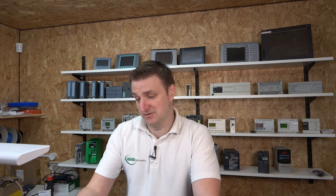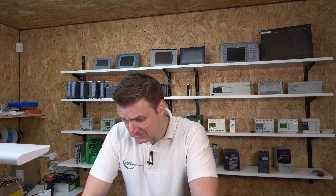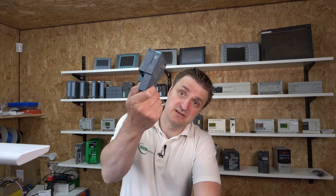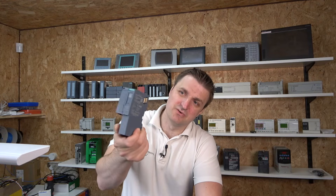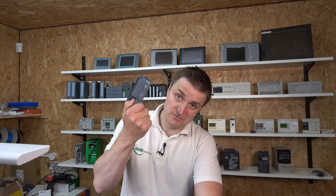It also comes with its own PLC if you wish - you can buy the ET200SP PLC with its own CPU so you don't have to have an external PLC for it. In our case we're not going to be doing that, probably in the future we'll be checking it out. So at the moment we're going to be connecting this interface unit here, which is basically the most common one that everyone uses - the ET200SP interface unit.